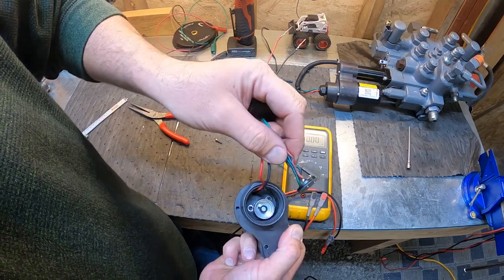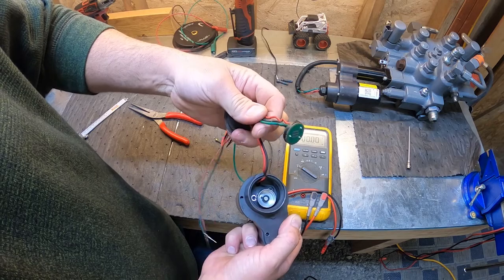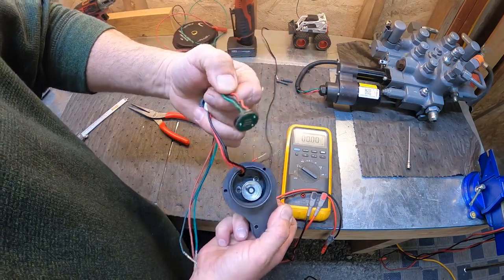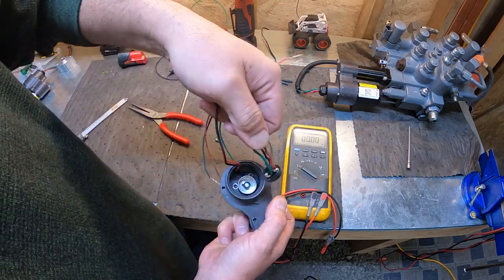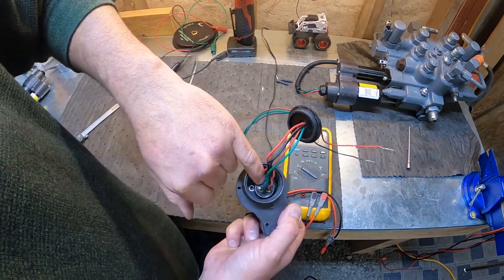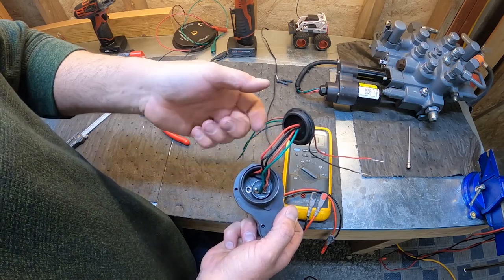Well, look at that. Can you guess what the failure of this actuator was? See this Hall effect sensor, the whole top of it just came off. Could that be fixed? Sure it could. If this was my machine, I would just epoxy that top right back on that Hall effect sensor. It doesn't matter where you put this sensor on top of that magnet right there. That's a rare earth magnet. Magnetic field for the Hall effect sensor picks up position, but wherever you epoxy that back in, then we just have to recalibrate it on the inside. So that's what our Hall effect sensor looked like from 2004 all the way up to about 2018. Then the Hall effect sensor changed a little bit.